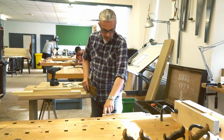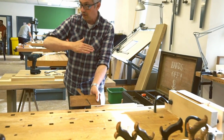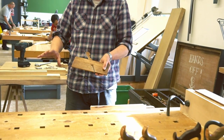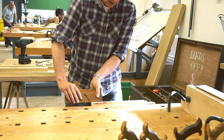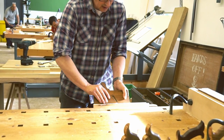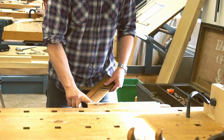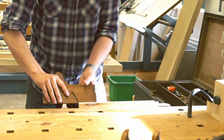I'm going to round over this sharp edge here, this sharp corner. Hold it pretty much like that, about 45 degrees off of that curve. You've been planing for a long while now, so the idea of keeping the pressure even all the way along the top — you're probably getting that with a smoother plane. It's the same principle with the moulding plane: keep the pressure nice and even all the way along the cut. Because if you don't, it's very easy to have a heavy cut here, heavy cut there, and not so heavy in the middle. It looks a bit uneven, so watch out for that.